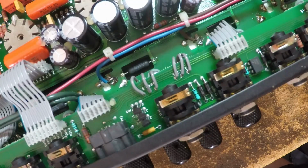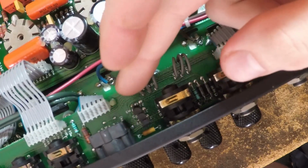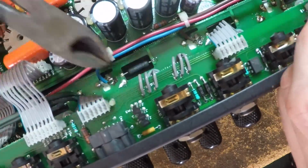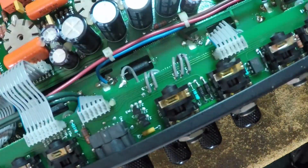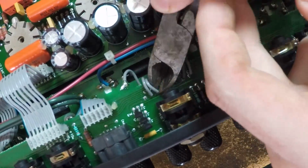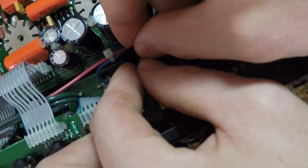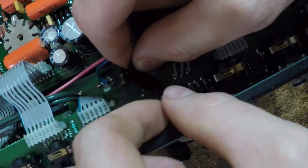These are the 3 wires we're going to be cutting. They're the leads from the return jack of the effects loop. Cut each one and move them out of the way. Bunch them up and use some electrical tape, and tape them up and place them somewhere out of the way where they can safely live out their days. I just tucked them under these red and blue wires.